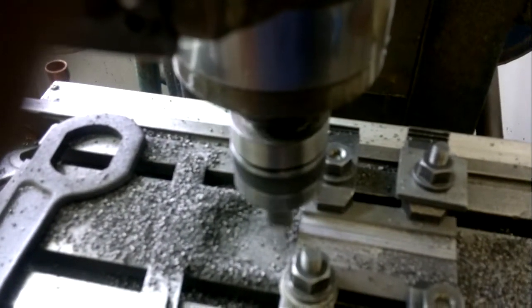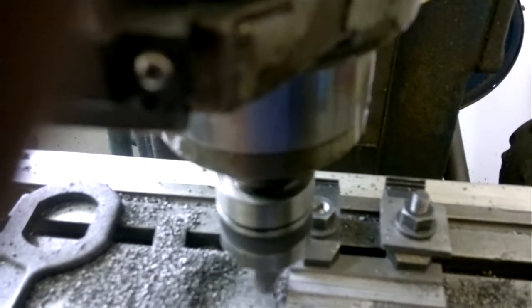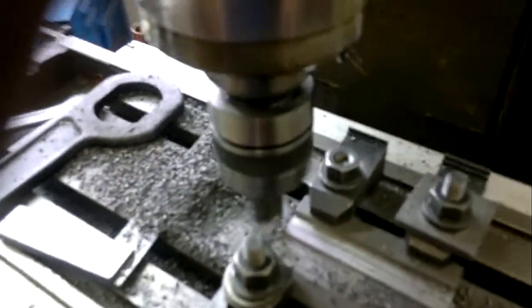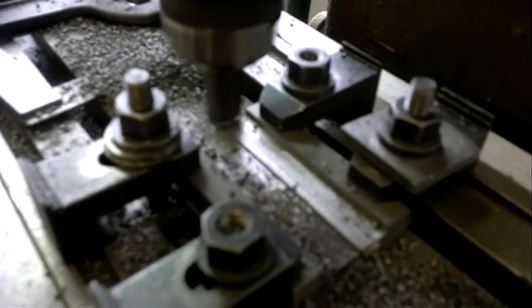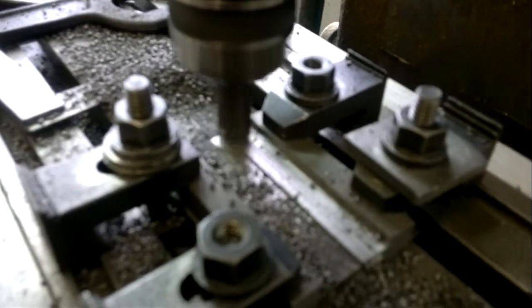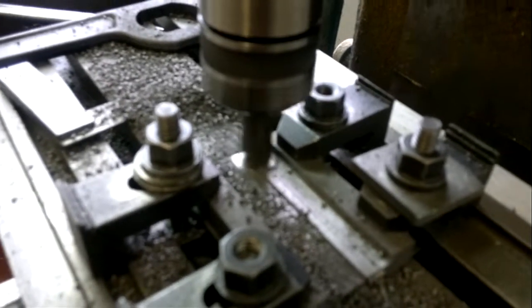We'll just bring the spindle down to 187 and a half. The down feed is always a bit fiddly — seven and a half, eight, seven and a half, there we go. Then we just pull the cut in again. We should now be coming down to the same level as the previous cut — you always get a little bit of a mark, a witness mark, as the head's never really vertical, but it's pretty close. And there we go — we'll take a look when we finish.